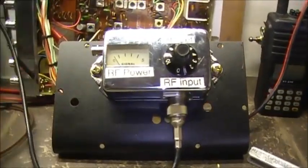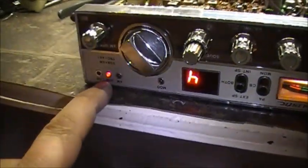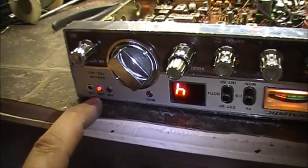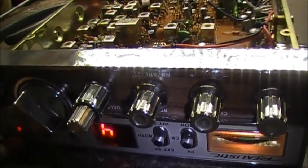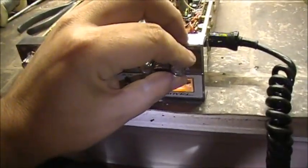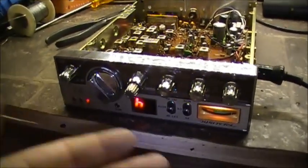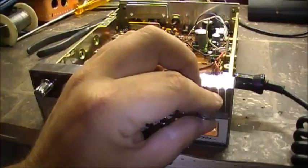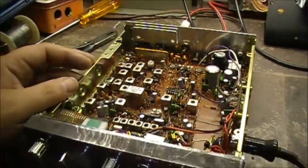So it's got a little bit of something still going on here. When she switches to sideband, there's something in that switching circuit that isn't supplying voltage correctly. Test one two, one two — we still have no modulation, so there's still something not right. Obviously sideband runs off audio. So now we've got to figure out what's going on with that.